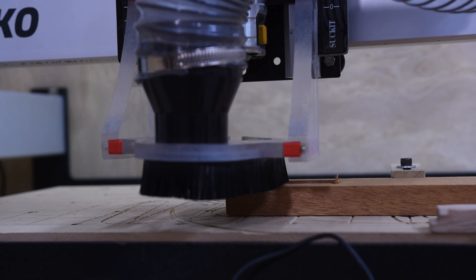Any questions on how to probe? I think we've covered them all. Maybe not the most exciting video, but for those of you that need to learn how to use a touch probe, hopefully we've answered that question. We showed how to probe the X, Y, and Z axis. We showed how to probe just the Z axis. We didn't use any V bits or anything like that, but the only thing you can probe with a V bit is going to be your Z axis — nothing changes. Put the bit in, alligator clip, just like you would. Thanks for watching the video. Hopefully you learned something. If you have any questions, put them in the comments and I'll try to answer them.